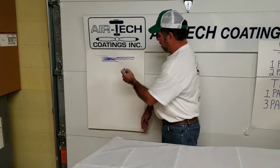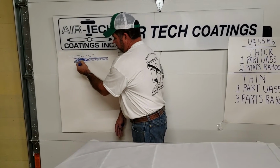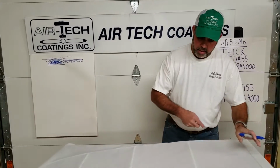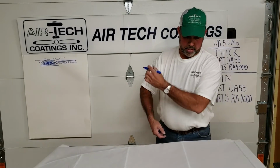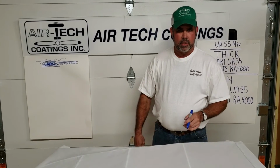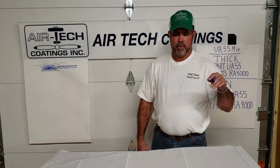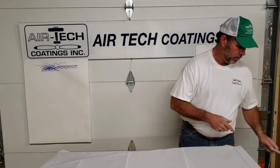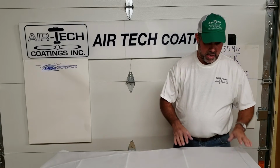We'll look at that, especially when you need to put another piece of fabric on top of this. You're going to need to build this on up and get another layer of thick glue for this one to stick to this. Many times people get in a hurry, and they start putting a tape over something, and they've just got the thin glue and they've laid the tape down, and yes, it paints across and it looks like it's stuck, and it may be fine for 30 years. But at one time someone's got a pressure washer or is doing something, and that tape really didn't have enough glue on it, and there wasn't enough glue carried through the tape to make that stick. I'm always apprehensive and concerned about there not being enough glue. That's why we always go thicker on the structural parts, and the thin is to carry it through the fabric to the next.